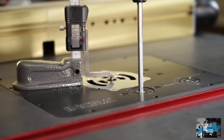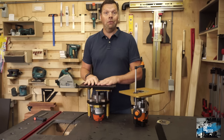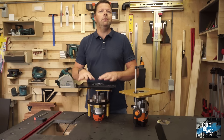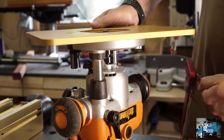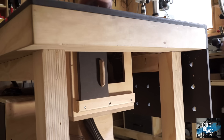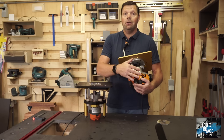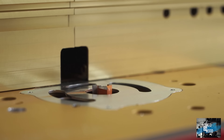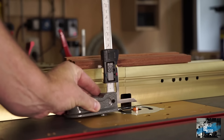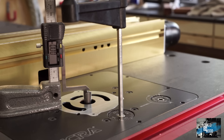The Masterlift has its locking mechanism on the upper side of the table, so you can use it almost entirely above the table. What surprised me is that when you adjust the height and clamp it in place, it shifts almost one-tenth of a millimeter. With the Triton, it almost does not shift at all — clamping carefully, a deviation of six to eight hundredths of a millimeter is nothing to worry about. For clamping the Triton you need to go to the underside of the table; I read on forums that people dislike this, but I found no difficulties. It goes very fast and you hardly notice it. Always clamp it — after using it unclamped, I saw the router bit fall. I learned that the hard way. When clamped, the bit stays perfectly in place, and the same is true for the Masterlift.